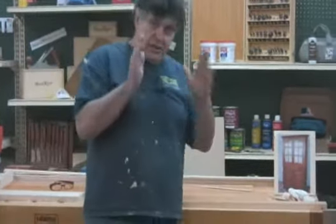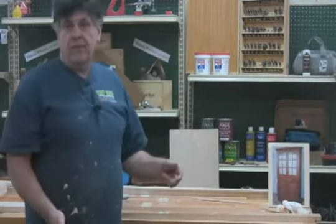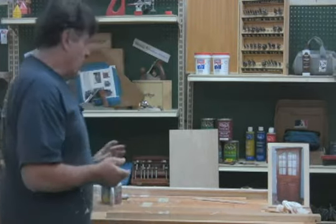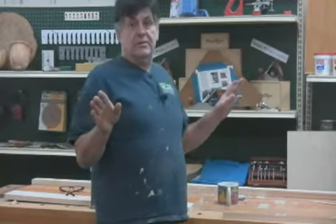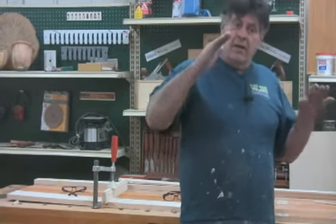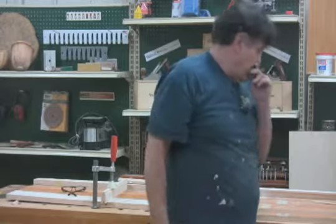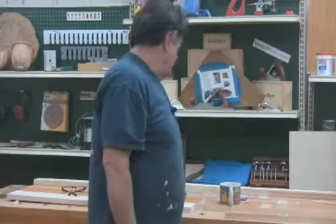But the same thing applies. When I start cutting these into narrow pieces, I'm opening up these sides as well. And just like that loaf of bread we talked about, now it's drying all the way around, and it can move. There's obviously a stress point somewhere in this wood for some reason. Okay, there's nothing really evident. But each one of those boards, one came off the top of the other, and only the top of it wanted to move a little bit. The bottom case pieces are laying here, and they're dead flat. They haven't moved a bit.